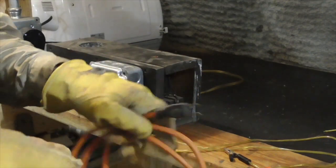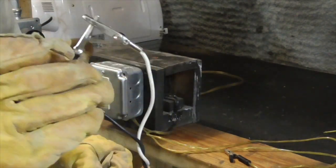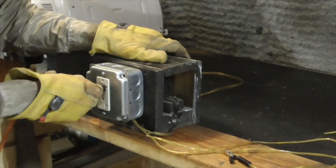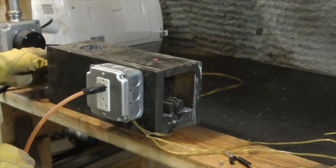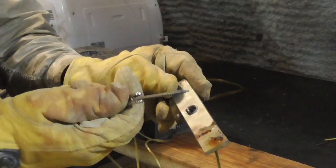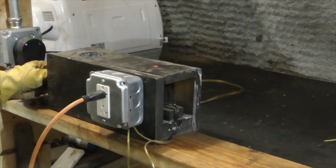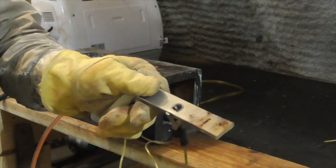To test this hypothesis, I wired a spare electrical outlet in series with the output of my 20 amp bridge rectifier. Now if I short across the outlet so that it doesn't act as an open circuit, and then connect the output leads to a couple pieces of scrap metal and touch them together, I'd just get one quick spark and then the circuit breaker trips. If the breaker failed to trip, I would still just get one quick spark and then the rectifier diodes would overheat from drawing too much current and explode, interrupting the flow of current just as effectively, if somewhat more destructively.